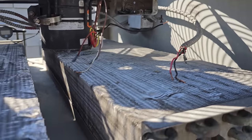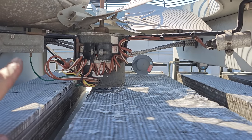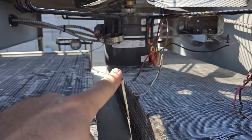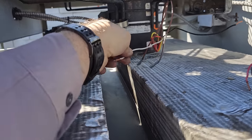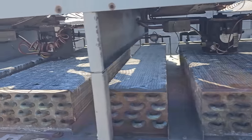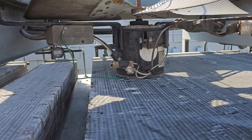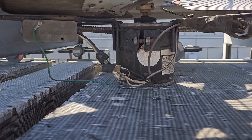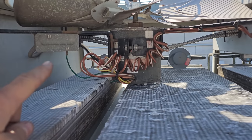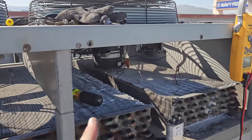We'll fire it back up. There's not an identical motor in here — wait, this is a three-quarter. This is just a newer one — a Mojave motor with updated wiring and a smaller insulation jacket. It does say it's allowed to run 4.7 amps, which we were under. The other motor I was comparing it to was an A.O. Smith — you can't go from brand to brand and compare current draw because this one is allowed to do 5.1 amps. It's very possible that something just got wet during the rain, so we're going to clean it up and put a new capacitor on this. I have isolated the motor. We're going to do an insulation test.